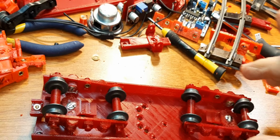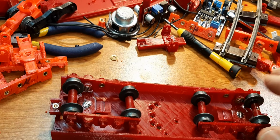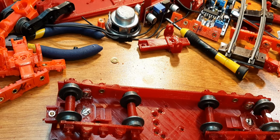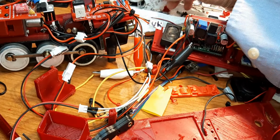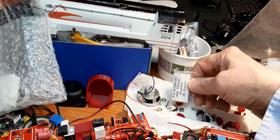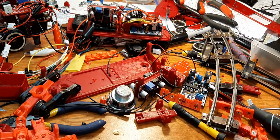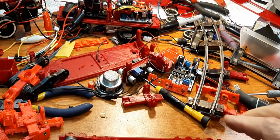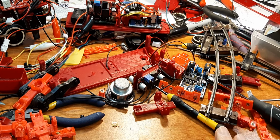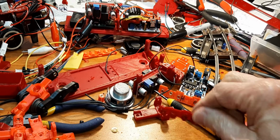Then when I got them all assembled, they were a little floppy out here on the end, a little too much going on, don't know what. They're thinner, of course, so they're going to have more flex, but it wasn't right. So I had to go get my shim supply. Thank goodness I had a .005 thrust washer from the motors that we use on our armatures, and I put a .005 shim on each of the wheels. Bingo, everything came together. It's nice and snug. We got good travel, no screws backing out on us. I think this is going to be it for the wheels.